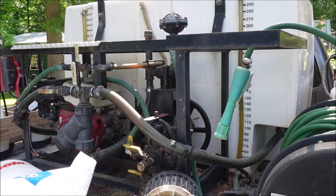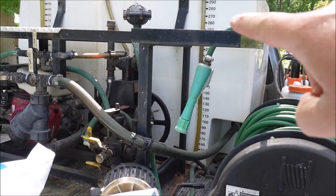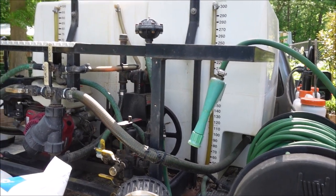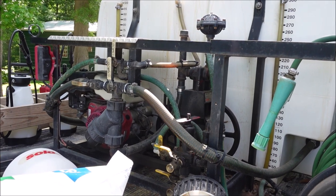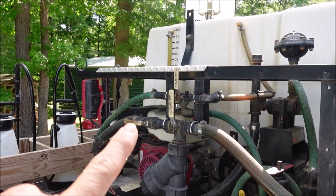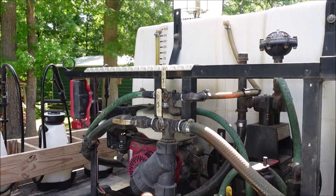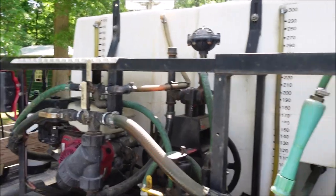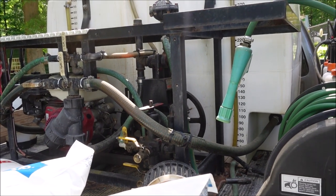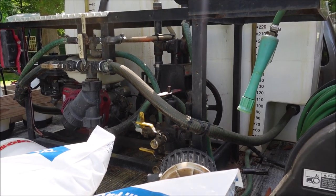This is a 400-gallon split tank. On the right side, you can see the little numbers — that's basically a sticker in a tube — and that side holds actually 310 gallons, but I just call it 300. The other side holds 105 gallons, we just call it 100. So it's like 300 on the right side, 100 on the left side. You'll see these yellow valves right here. When one is turned that way and those two are pointed up, it's pulling from the small side. If I flip those two on the right down, it's going to start pulling from the large side.